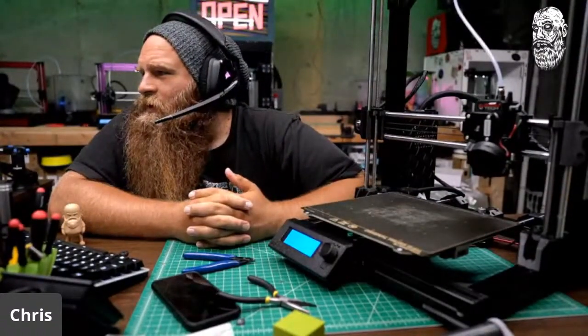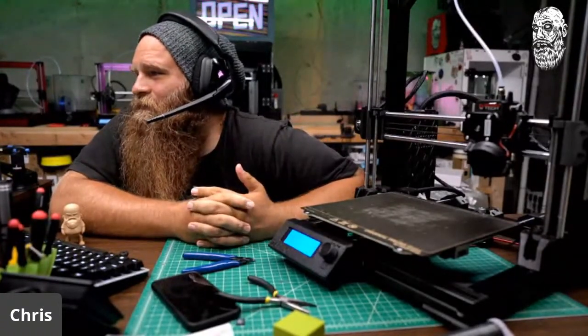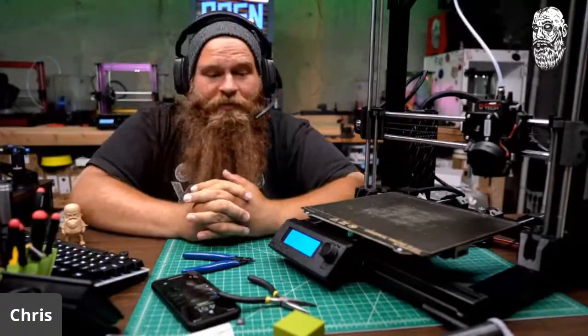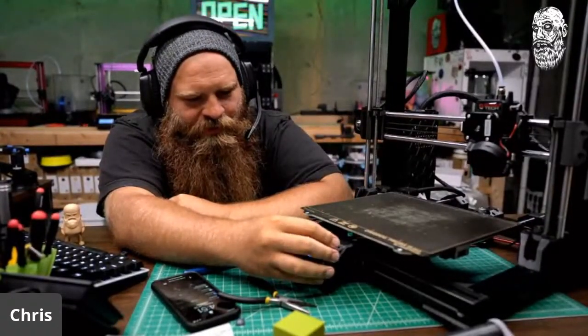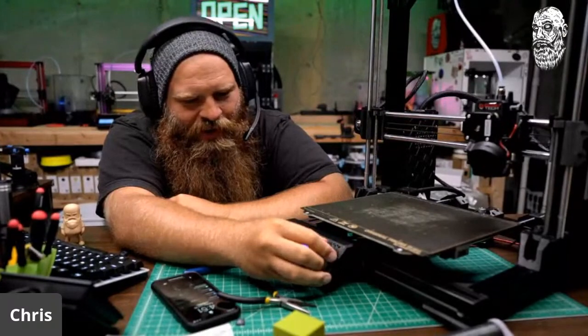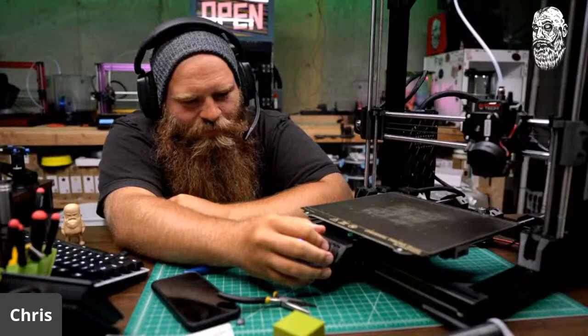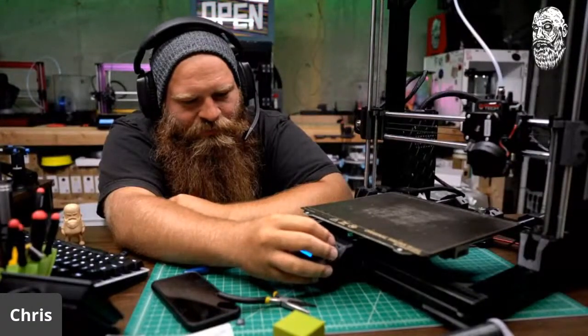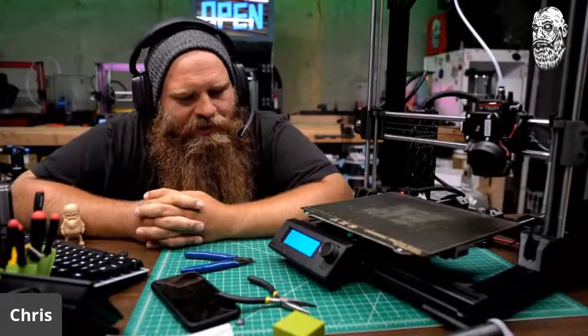I want to review the stream settings again. I want to implement. Yeah! Oh yeah, let's make sure the heaters work. So let's go ahead to temperature. And oh my god, I have 5 different preheats now. Let's go ahead and preheat for PLA, and we'll do both. So preheat the bed and the nozzle for PLA.